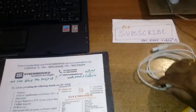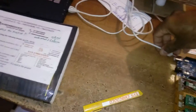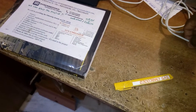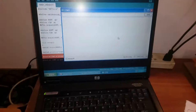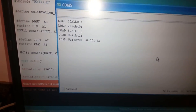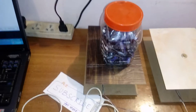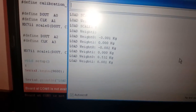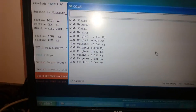Now I am going to use one load machine — okay, this is 530. I am going to give the power supply to the Arduino board and test individually. In the serial monitor, load cell zero is reading 530, and load cell one is reading 530, 532 — plus or minus 5%, around 531.